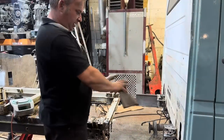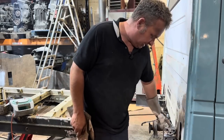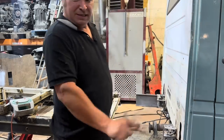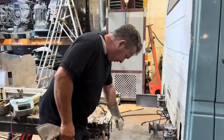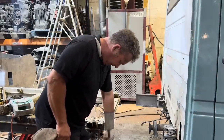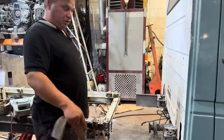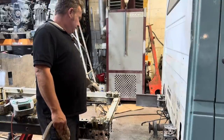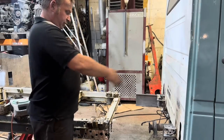So, as many holes as I could drill. Perfect spacings don't really matter, because all of these are going to be plugged full of weld and ground off. So to be honest, you won't even know they're there. Obviously, it's impossible to make the mag drill work upside down, dangling off a non-flat surface on the bottom of it. So I plasmaed the holes in there. I'll tidy them up in a minute. And then basically, with a bit of cleaning up, we are ready for the big slide.